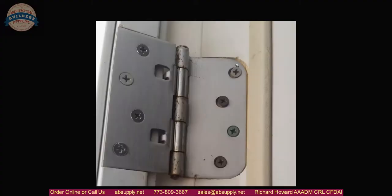So you need to not only re-drill these holes, but you'll have to mortise deeper on both the door side and the frame side. At the end of the day, that's carpentry work — there's nothing special or unusual about doing this. You've got room to get the thicker hinge in there. You could get away with doing double mortise depth on one side, but that would not be considered best practice, though it is done at times.